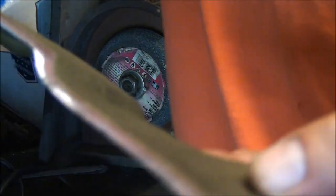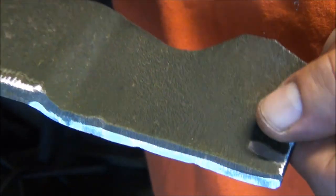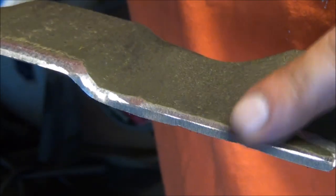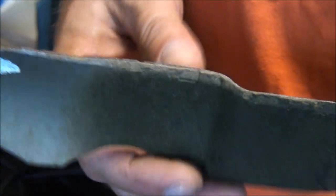As far as this side goes, it's starting to look pretty sharp to me. You can see we're good and sharp here, and sharp at the bend too — a lot of times you have to focus on that little bend area as well. I'm going to finish this off with a hand file to get the angle equal and consistent. Then I'll go ahead and finish up the other side and attach it in my vise to show you how I finish it with the hand file.